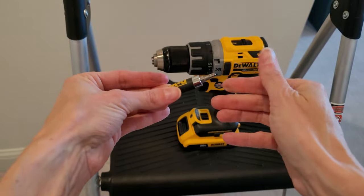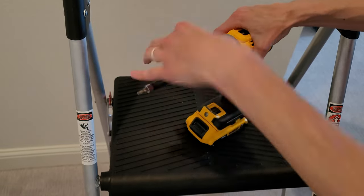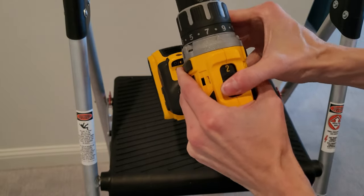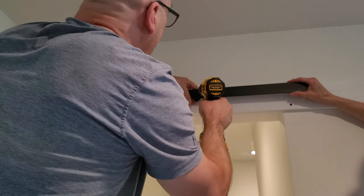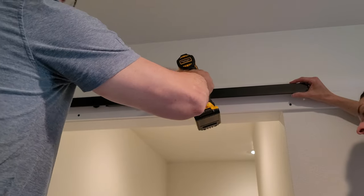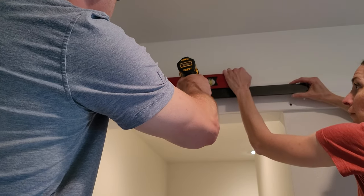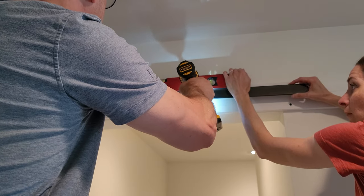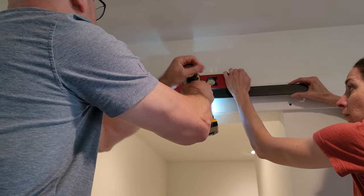Once your pilot holes are drilled, go ahead and add your screw attachment. Change back to one for screwing, and set torque to about eight as a good starting point. Put the spacer behind the rail and line up your lag bolt. My husband took care of this part — it takes a little bit of muscle. We made sure the rail was level, because things can shift even though we marked our holes level. This is the part where you're installing your rail with the soft close already attached.